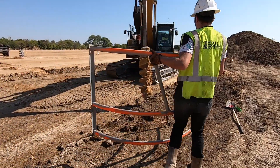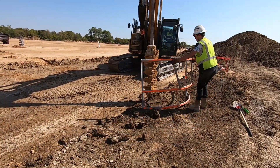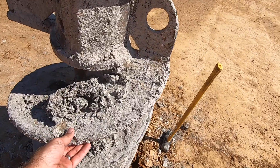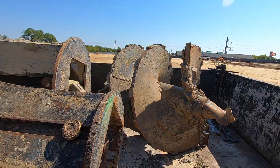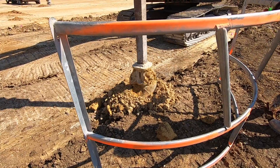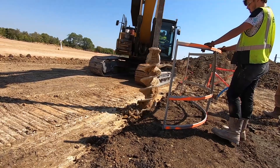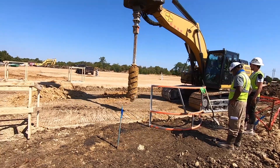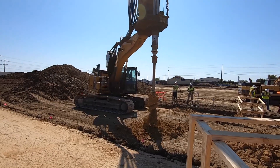We've got a lot of piers. Today we're only pouring probably four or five. You can see they've got this massive drill bit — and actually this is the smallest of the three. They've got an 18-inch, a 24-inch, and a 36-inch drill bit in total. Today we're doing the 18-inch, going 18 feet deep. You can see where they start drilling — they go straight down, and every two to three feet they pull the drill bit back out because it gets clogged with clay and dirt and they have to knock it off.